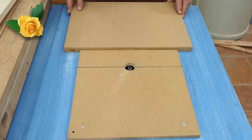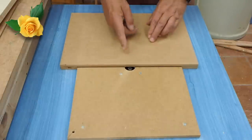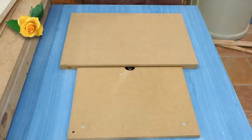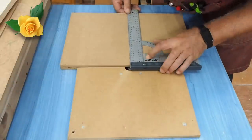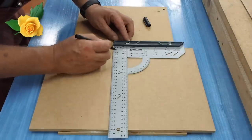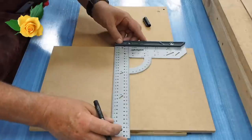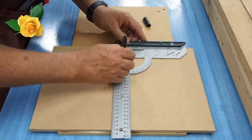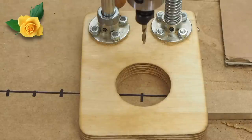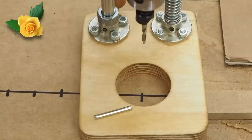Once it has set, you can see how well it slides in and slides along and reaches exactly where it needs to. Now we need to draw a line exactly at the center, perfectly square with the center of the router bit. And there we have our line. Now I'm going to mark every two centimeters — I'll make a mark on the line. And now at each of the marks we've made, we drill a hole.